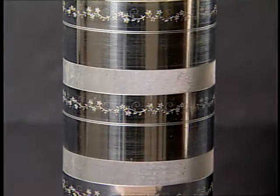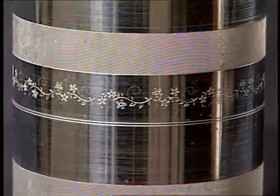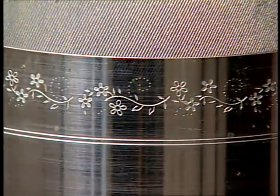In this method, a heavy copper cylinder is engraved with the print design. Copper is soft, so once the design is engraved, the roller is electroplated with chrome for durability.